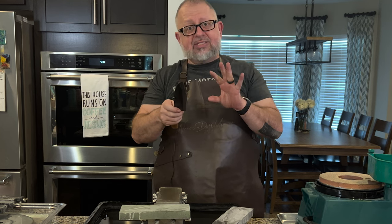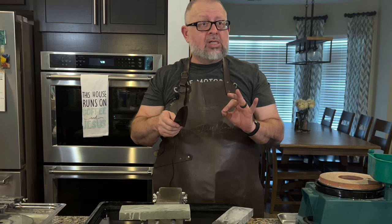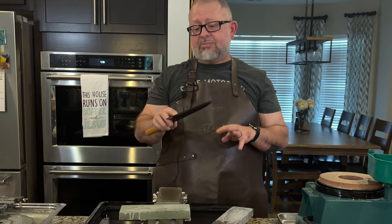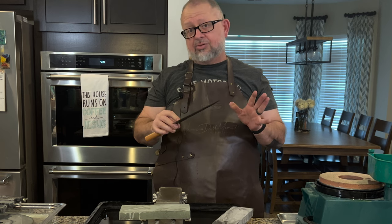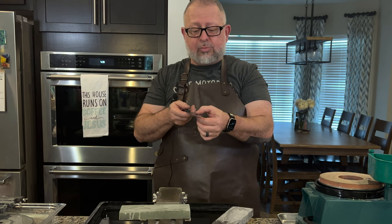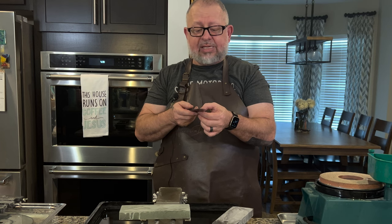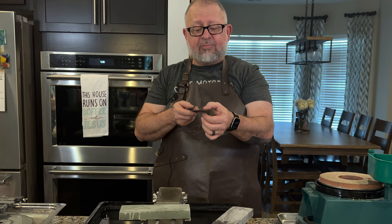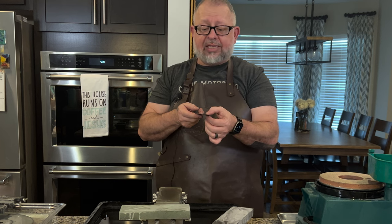Thinning is not sharpening, thinning is not polishing, and a lot of times it seems like thinning and polishing are in the same family — they're very close. The goal of thinning is to remove the thickness of metal. In this particular case, the goal was to remove some of the iron cladding — or even if it were stainless cladding — to expose more of the core.